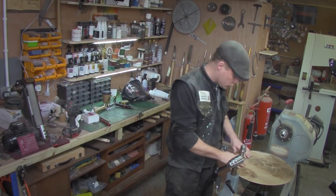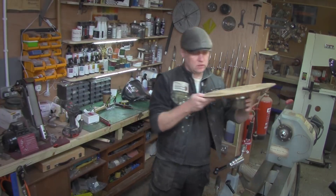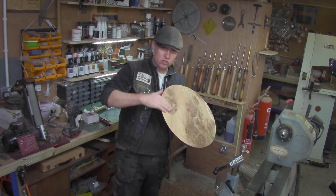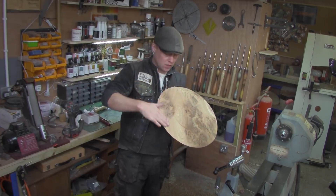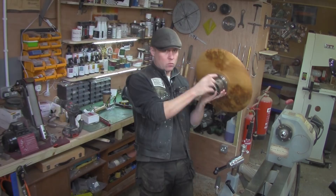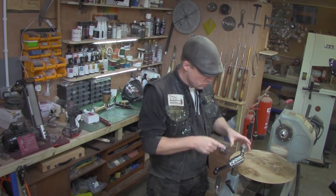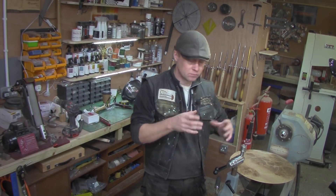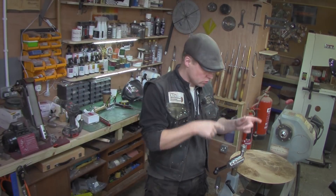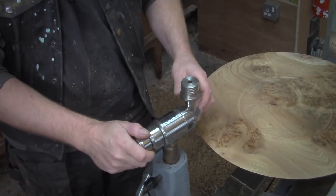Now the rim has been sanded down to 400 and I want to fill this area up with coffee grind, so I get a nice smooth surface round this part of the piece. I want to keep it on the chuck so I can just mount and remount it as necessary, particularly for the next step. So I'm going to use the Woodcut pro mount to hold the piece on the lathe. I've only recently got it and this is the first time I've used it, but it looks like a really cool piece of kit and going to be very useful.